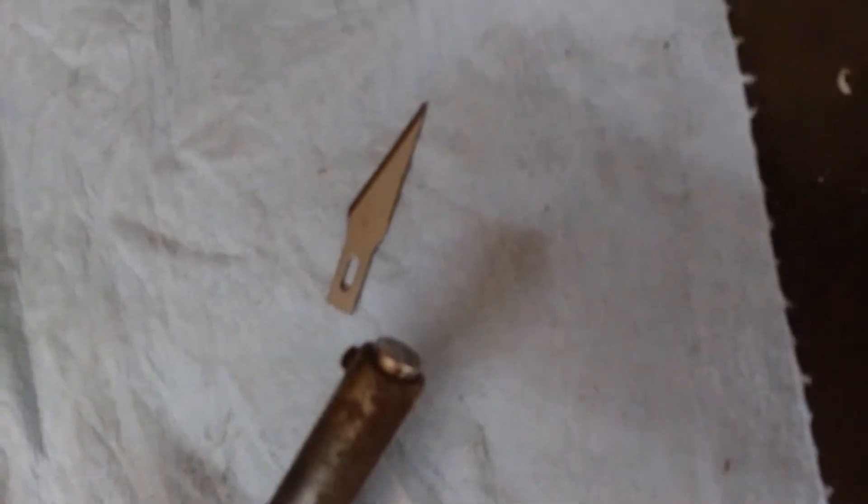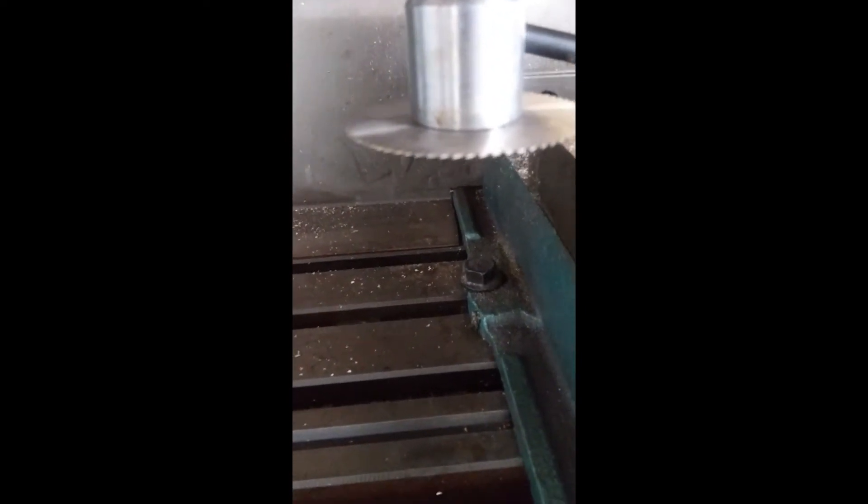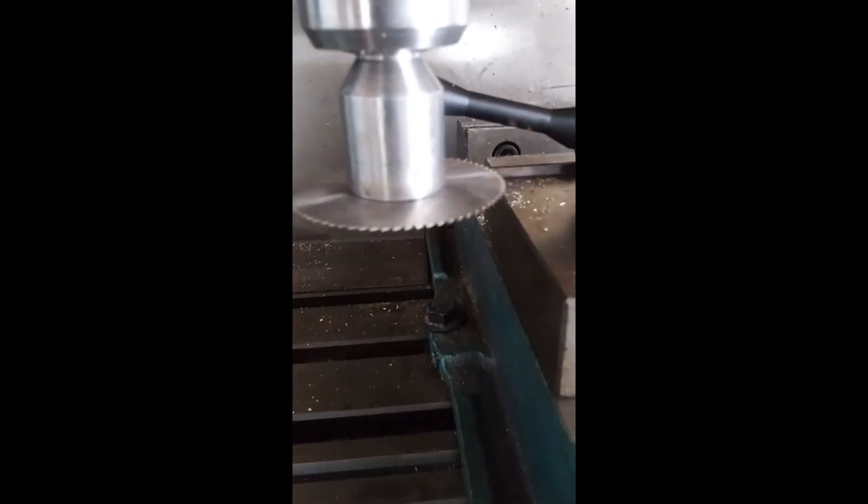The reason I'm doing this is I've got a project where I'm going to have to use a hot knife, and I need the blade to be as thin as possible. I thought an X-Acto knife blade would be perfect — I measured it at 20 thousandths. I actually ordered this slitting saw just for this project; I've got a handful of slitting saws but all of them are thicker, so I needed one that was exactly 20 thousandths, and this one is.